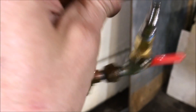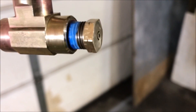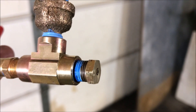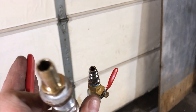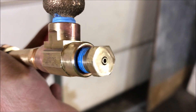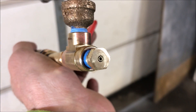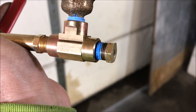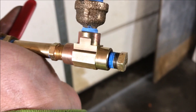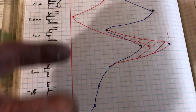So despite the fact that it draws a higher vacuum at a 1.5 millimeter extruded position, it still doesn't have as powerful a spray pattern as flush does. Flush appears to pump more - I haven't done any testing to confirm that, but just a visual corroboration will do for me. You can clearly see it was pumping more when it's flush. Did you see that valley where it reaches a certain point and just drops off? Some type of invisible shockwave or something is moving through the discharge zone. So we see this big dip in the graph.